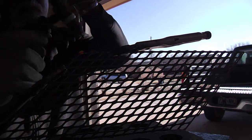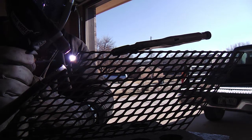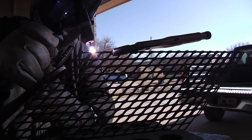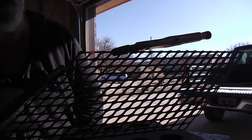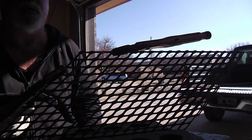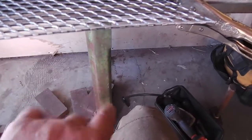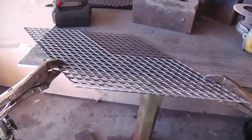I'll do about three of them. Just a nice tiny little arc — makes this dainty welding quite easy. I'm only on 110 power here, not using much amperage at all. There it is hit with the flap disc — seemingly seamless. And there it is without the flap disc, just the autogenous welds — it'll look fairly seamless.